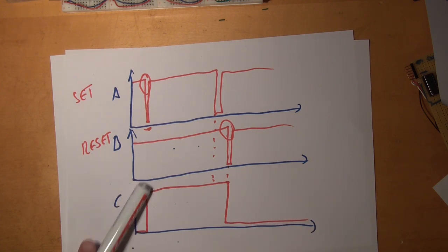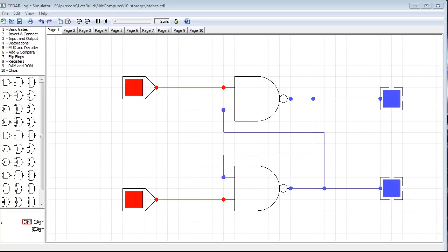But why is this the case? Let's look at this in software. Here you see the very same circuit. When something is true it's red, when false it's black — currently they're blue because it doesn't know. A NOT-AND gate is true when not both inputs are true. With one true and one false on each gate, both NOT-AND gates are true. But look how it's wired: if each NOT-AND gate is true, then all inputs become true, making the NOT-AND gates false, which makes them true again. In other words, it vibrates back and forth. In reality though, one of the two NOT-AND gates will be slightly faster, and that's enough to choose the state — so it doesn't actually vibrate.